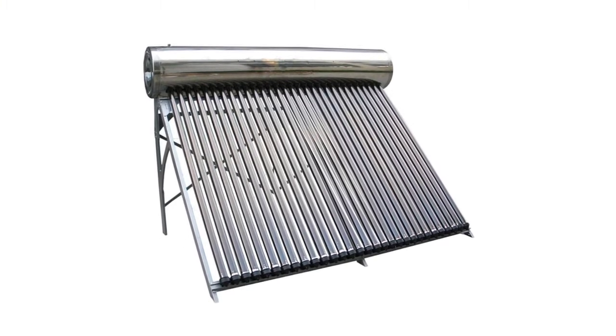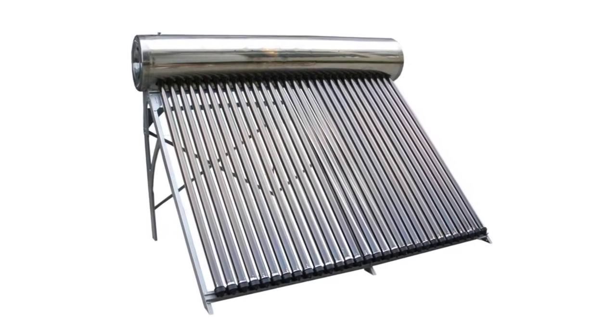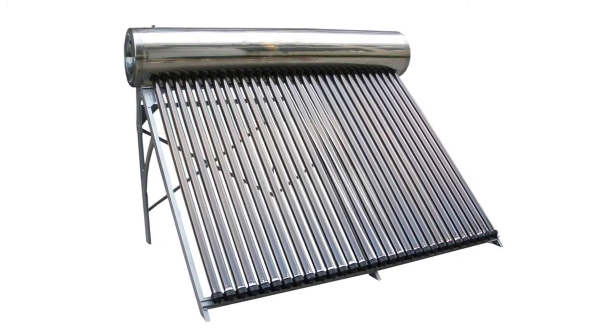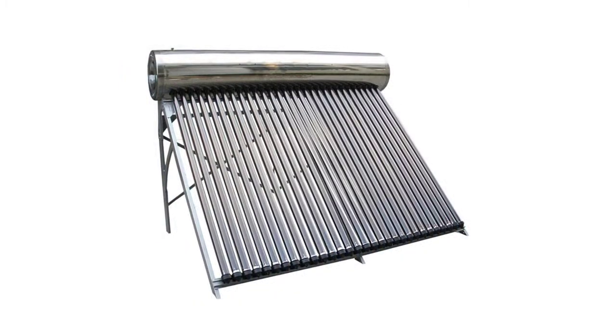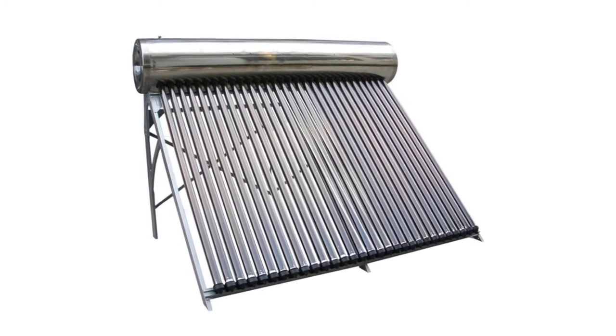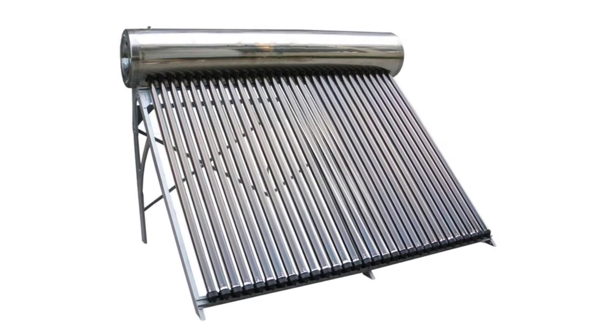At number three: Duda SUS304. This solar water heater with an attached tank uses passive solar technology — vacuum tubes with heat pipes in an attached water tank for direct heating of potable water. Sunlight enters the tubes, converting into heat at approximately 94% efficiency, and is then carried up through the heat pipe to the manifold, which heats the water inside the attached tank.